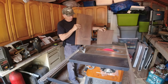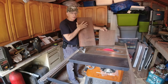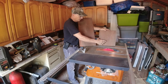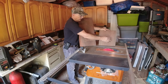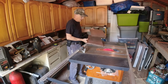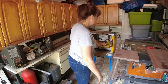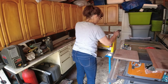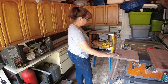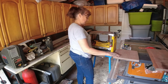That's what I'll need for the sewing machine cabinet. This is all going to get planed down to quarter inch and cut up into small pieces. This will get planed down to three-eighths and cut up into the lid and the trim pieces around the bottom. So Diane will get that all planed down and we can cut it up. I need to set the planer to the correct depth - I'm not going to take a heavy cut because this is walnut and this is not a really expensive planer. So let's get to cutting.